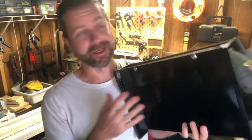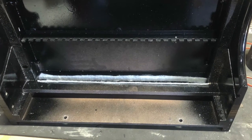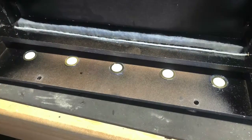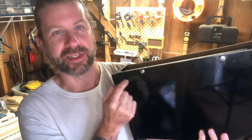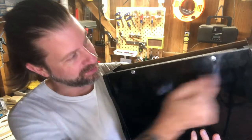So what I did is I took it apart and took the tone bar out — I had done that in an earlier video where I showed you what was inside. Then across the back here I put five piezo elements, or contact microphones, whatever you want to call them. I put five of them equally spaced across the back here on the inside, and just hot glued them in place.